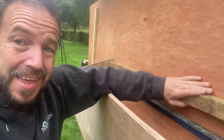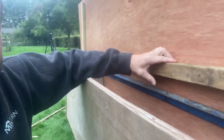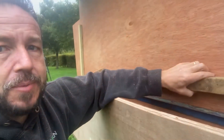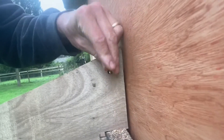A little tip if you want to fix something like this from the other side: I put some long screws just here underneath — one, two, three — and I rested it on, and I was able to see the screws from the other side. So I knew that when I came to fix my piece of timber from the other side, I came just a little bit above those screws and I'd be in my timber. Then what I've done is drilled some holes that are far too big for the screws, so the screws are just loose in there, and the holes are going diagonally downwards.